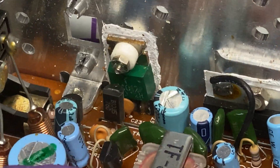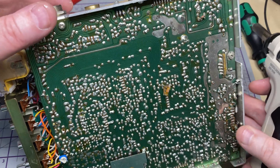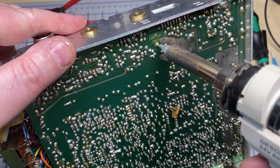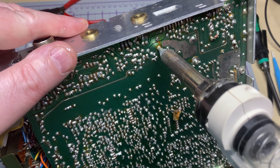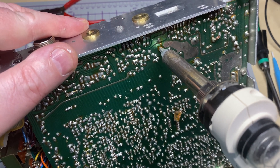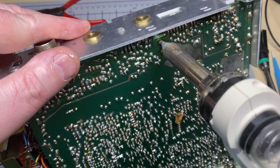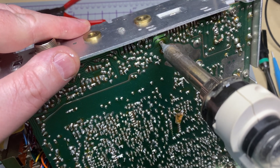So we're going to be getting rid of that corrosive glue, and I'm going to be doing some regulator upgrades. For a start, let's get these 1000µF caps out and get rid of that nasty glue.